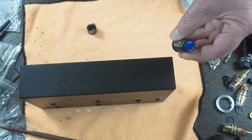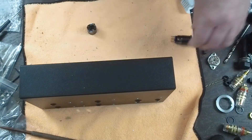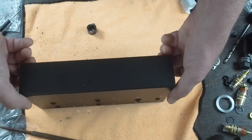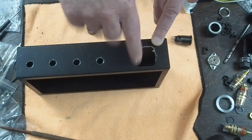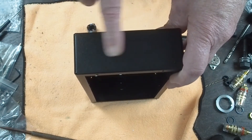Also, this will require — it's got a 12-volt LED, which it'll operate off about 8 volts or so — so I'll need to do a bridge rectifier to get 12 volts off the filament voltage to power up the LED. So it adds a little complication to the amplifier to use this kind of switch. If this is your first build, you might want to use a different kind of switch — maybe a combo fuse power connector, or just a simple SPST on-off switch.